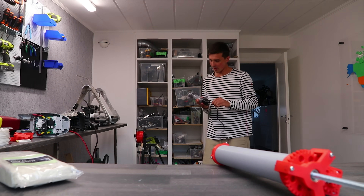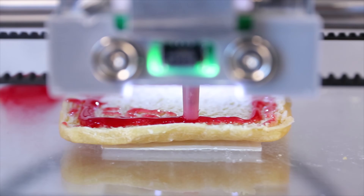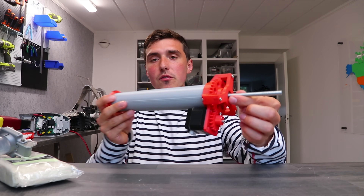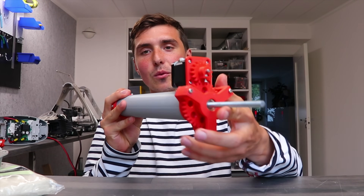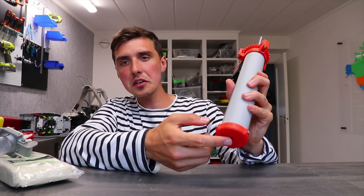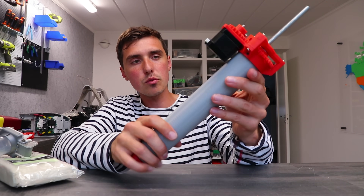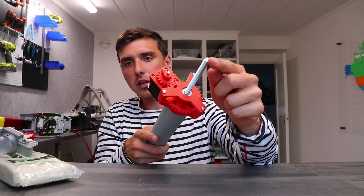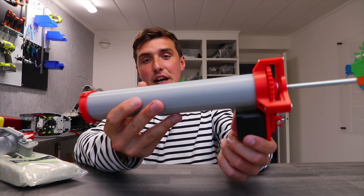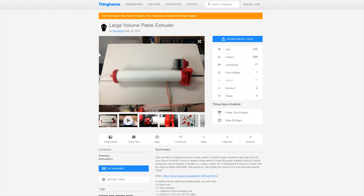Oh my man! Do you remember this? We are no strangers to working with paste extruders. This one I used to make a peanut butter and jelly sandwich, so we are pretty much semi-professionals if I say so myself. This one works pretty much the same way. There is the piston that is capable of moving downwards and squeezes out whatever substance you have in this pipe, by the help of this stepper motor that I literally just ripped out of my 3D printer. These gears make the 8mm threaded rod move up and down, and that's what's also controlling the piston. A very clever design — mostly because I didn't design it. This guy did, so thank you very much for making this awesome paste extruder.